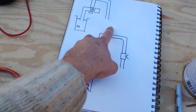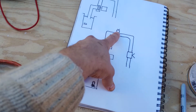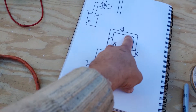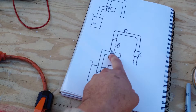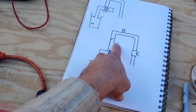Now this whole thing is full of water and water will start shooting out at the top. Then you close off the air valve and the priming valve. Now this whole system is filled with water. When the pump starts spinning, it's not just spinning air — it's actually spinning water, pushing it through the check valves, and it will pull water up through the intake.